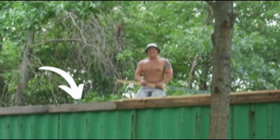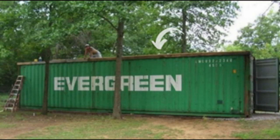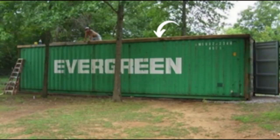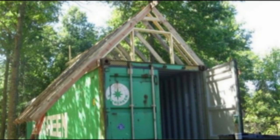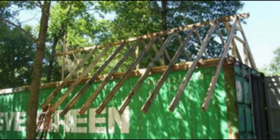I knew I wanted a peak roof on the container. I attached two-by-sixes on each side at the top, running the full length to support the roof rafters, and along one side at the bottom to support the floor joists for a future deck. I used four-inch self-tapping screws — the sheet metal and steel on this container is thick enough that you have to use a pilot hole first. They were widening the highway not far from my house and I was able — just by asking — to get telephone poles delivered to my property. I cut them to length with my chainsaw, dug holes, and cemented them in the ground to serve as post supports for my deck roof.